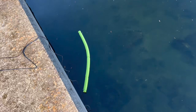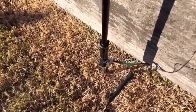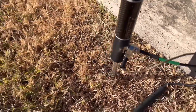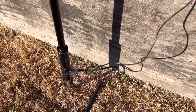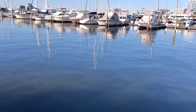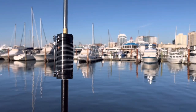Okay, here's my secret weapon. That's a pool noodle with a piece of wire on it — I've got about 17 feet of wire coming over. I brought the antenna a little closer, and instead of that connection point, I'm actually connecting it to the outside of the coax. I'm wondering if there's an issue with the coating of the hub and the stake itself. But now I have a single counterpoise going into the salt water. This usually works extremely well for me. If this doesn't do it, I don't know where to go next.